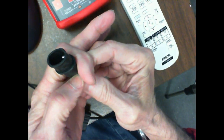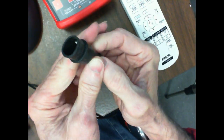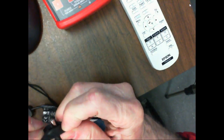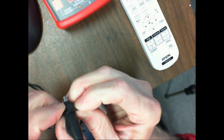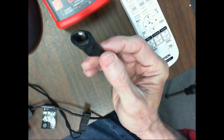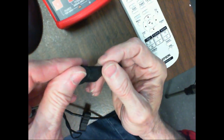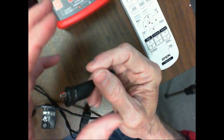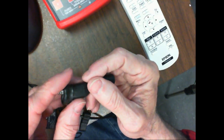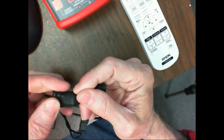If I fold that back or take it off, you take it off, then you dropped it down a lot. But if I was to come up here and fold this back, then what did I just do? I dropped the category down. Right? Because the more exposed tip you have, the more likelihood you're going to have, when these transients come in, that you're going to have an arc between your leads or to another section of your circuit.